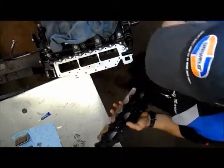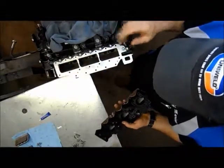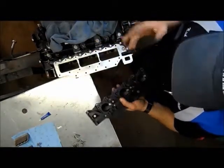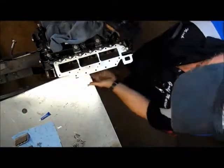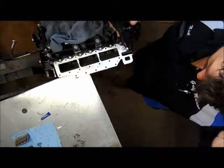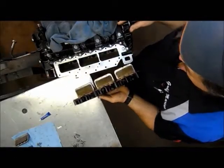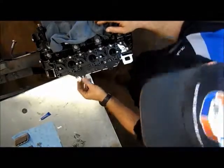Probably the main reason we don't use it. Plus, there's no water coming into contact with anything in the front of this, no high pressure liquids or anything like that. And there's no high pressure like in the combustion chamber, where you need that extra little bit of sealer and the higher torque values to properly secure it. So, we're gonna drop our reed box into there.